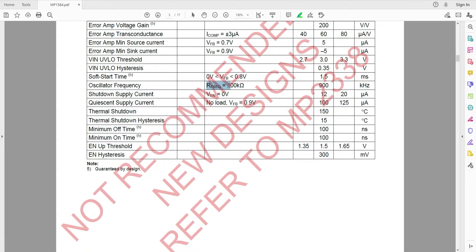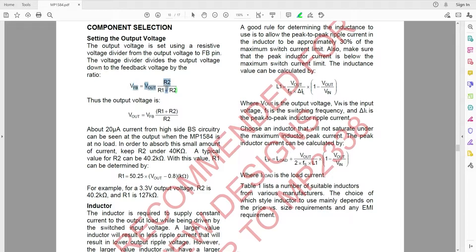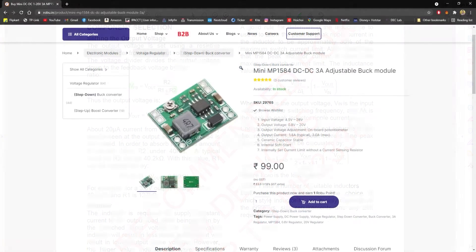The recommended frequency is 900 kilohertz when the frequency-setting resistor is set to 100 kilohms. Here is the formula to calculate the switching frequency if you are interested in making your own or customizing the circuit. With the help of this equation we can also set the output voltage — V_feedback controls the output voltage and is set by R2 and R1, which is simply a potential divider formula.